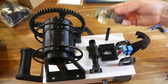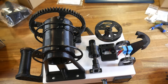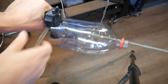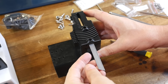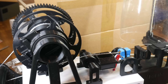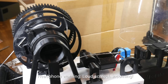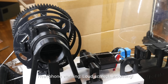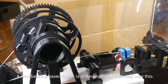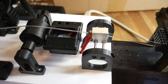There are a couple of variants, and what you're seeing here is the default version where the PET is already cut using the included PET man cutter — this actually ended up being my preferred version. Alternatively, you can install Module 1, which has an integrated cutter and bolts onto the end of the machine. It is much more efficient because the bottle is cut as it's fed through the pulstruder, but for me there was only one problem: the bottle squeaked, and this was insanely loud, and it takes quite a lot of time to process each bottle. So I stuck with the manual cutter just to avoid this racket.